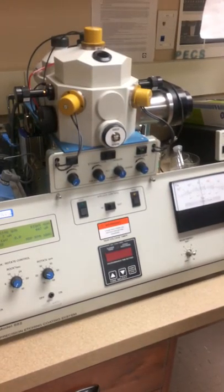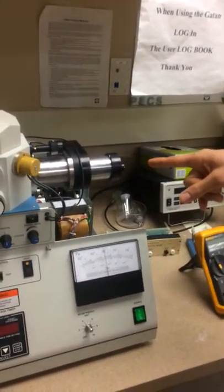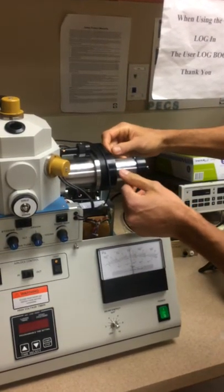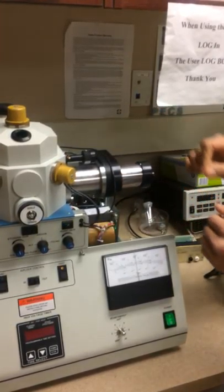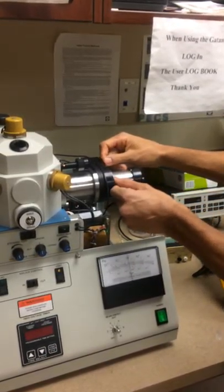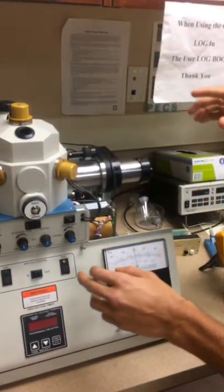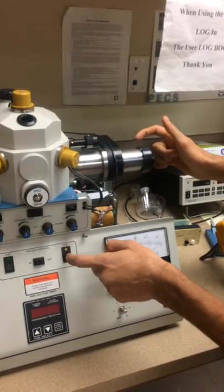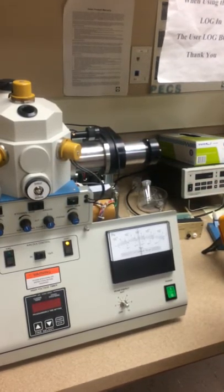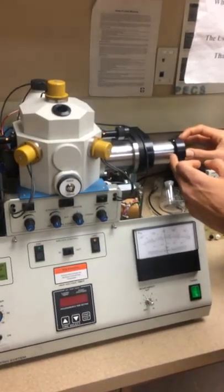I stop this and the detector comes out. There are two o-rings — it got stuck on the first o-ring, so you want to pull a little bit, and it moves a couple of millimeters more to the second o-ring. That's very important: if you vent without making it past the second o-ring, it will vent into the chamber, make a huge noise, and you'll freak out. It passed the second o-ring, so I hit vent, this pops out, I put my sample in, wait for that noise to end, and now I can vacuum it again.